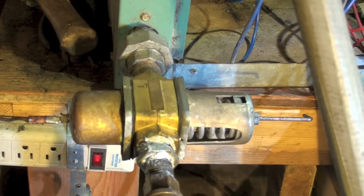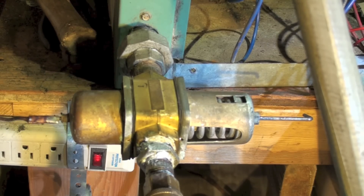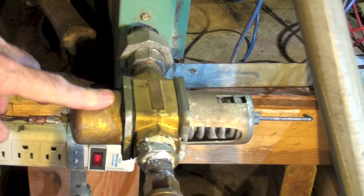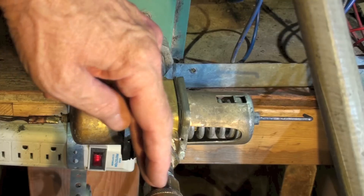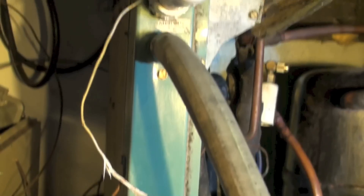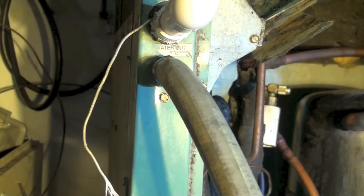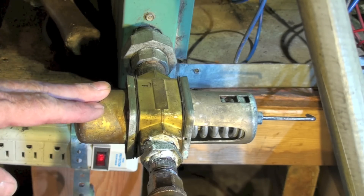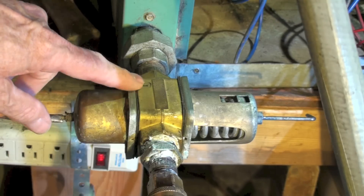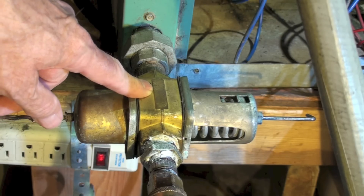This part here is a water valve - you can see a little cap tube on this side. It actually goes to the suction line or the discharge line - same line, remember this is reversible. What it does is control the amount of water that can pass through. Water comes in here and moves through the heat exchanger - we just have a hose on this for now as it's a temporary hookup, so water comes in the bottom and out the top. In cooling mode, this valve will not allow any water to pass through until it reaches a certain head pressure, around 220 pounds.